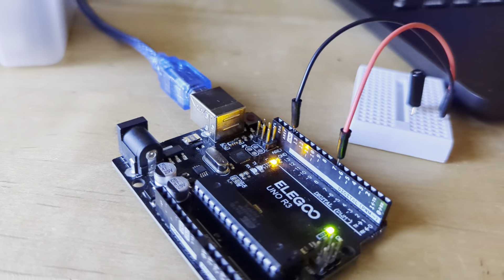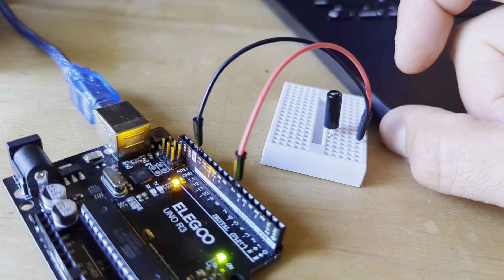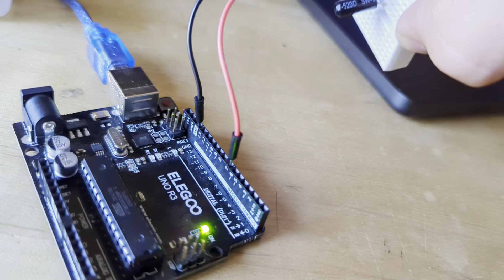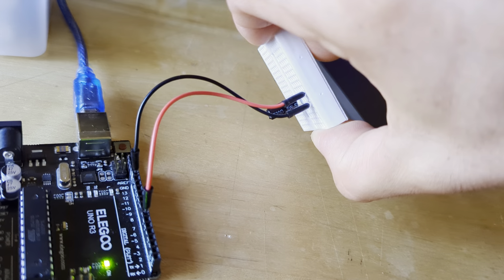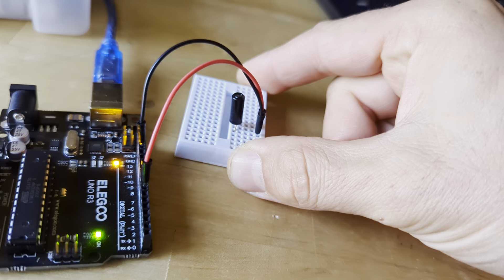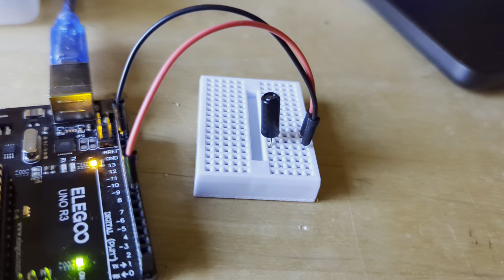The default setting here — the LED is turned on — tells us that this is giving us zeros all the time, which for INPUT_PULLUP means it's in its on state. Now, as soon as I tilt this upside down, the yellow LED turns off. So the feedback mechanism is just that yellow LED, but the gesture is just whether something tips over or not. Very easy to build. If it were built into a rattle, you can see it's turning on and off. Simple as that.